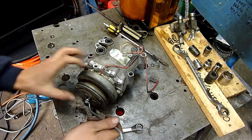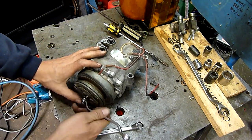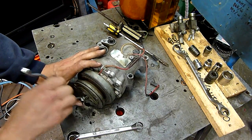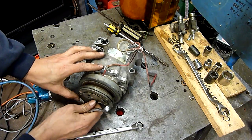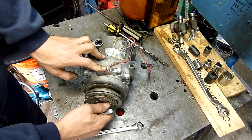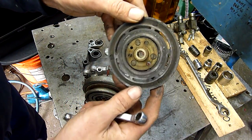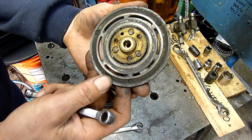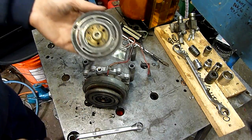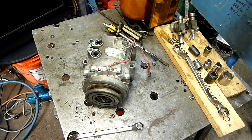I've already sort of gone over this, so I know what's loose and what's not, but I haven't loosened any of these off. I just wanted to make sure I can get the clutch off. This one's splined — it's not keyed. Very rough, too — you can see where it's been slipping. As soon as this compressor locked up, it would have just kept slipping against the clutch plate, making horrible noises.